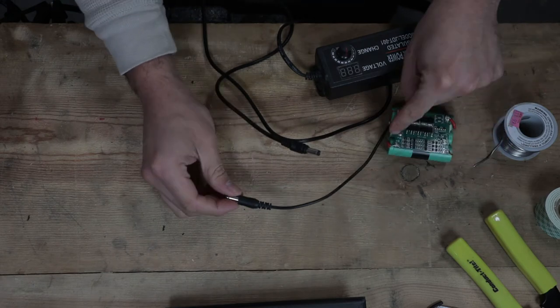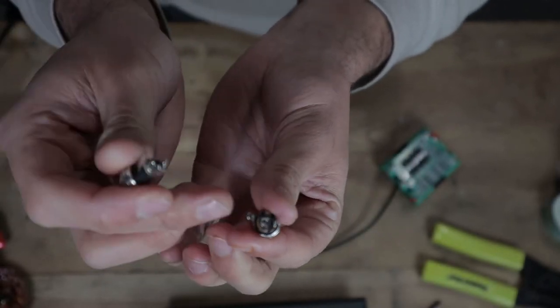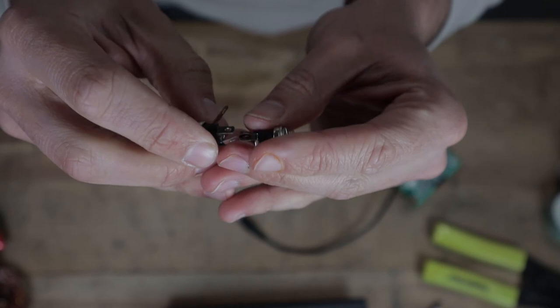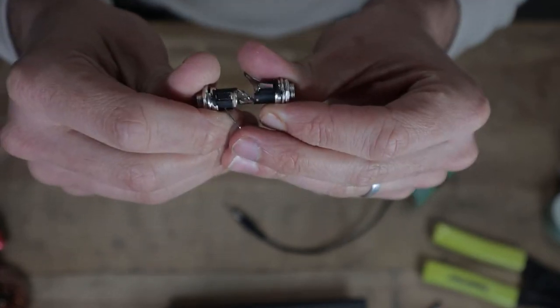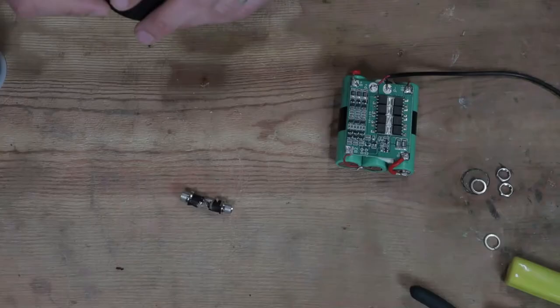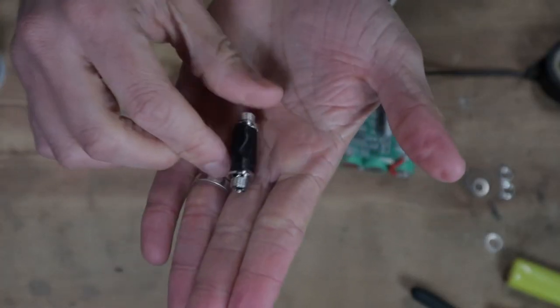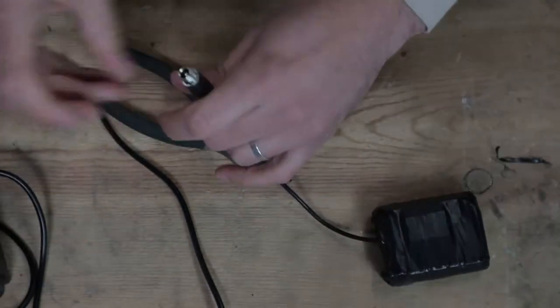That gives me my next problem to solve. I want to be able to use this charger to charge all of my batteries. It does have the exact same barrel connector, and I happen to have two female barrel connectors. So I want to essentially put these end to end and make a charging adapter — just plug this onto this one point here so I don't have to have a whole second plug just for charging. The middle post is negative, one post is not used so we can bend it out of the way, and we need to get the positive terminals put together end to end. So we'll just solder these ends together, then wrap it up in some electrical tape to protect it. So there is our little charging adapter. I'm also going to wrap this battery in some electrical tape to protect it.